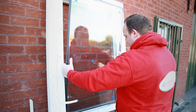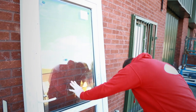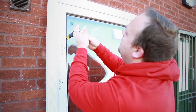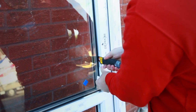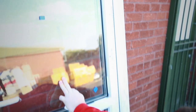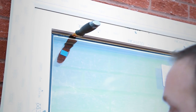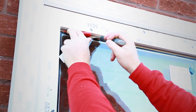Get it up over the handle and just drop it in — easy as that. Then just start levelling off the glass, getting it nice and level on both sides. There's one at the top as well, and that just lifts the door up so it doesn't sag over time. It keeps it nice and level, so the weight of the glass is actually lifting the door.